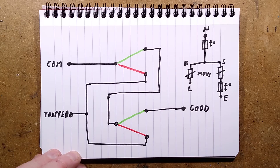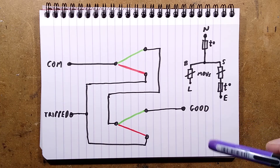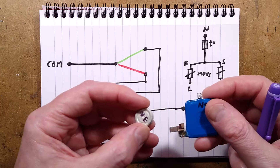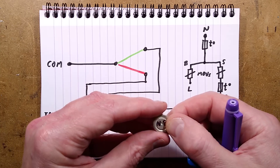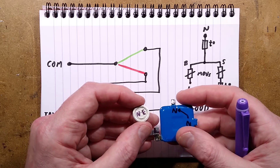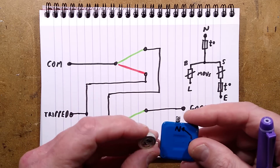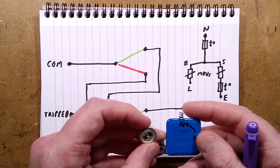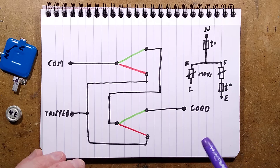The switches are quite clever - probably one of the most sophisticated parts. This metal oxide varistor is really big, I wasn't expecting that. The chance of a significant voltage between neutral and earth is fairly low, it's more likely in TT type systems. But it can also happen when you have a failed electrical distribution system where they lose the combined neutral and earth - the TNCS. It's a really common failure where all the houses in the neighbourhood suddenly become live with respect to general earth. Cable joints aren't necessarily well designed.